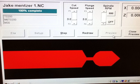From there you can click on Preview and it will run through what the cutter is going to do. If it just cuts off the part, or if it's very thin or too thick, now is the time to go back and change that BobCAD file — not after you've destroyed a piece of wood.